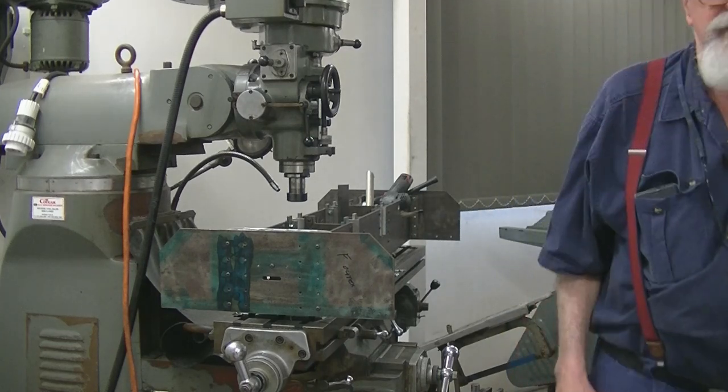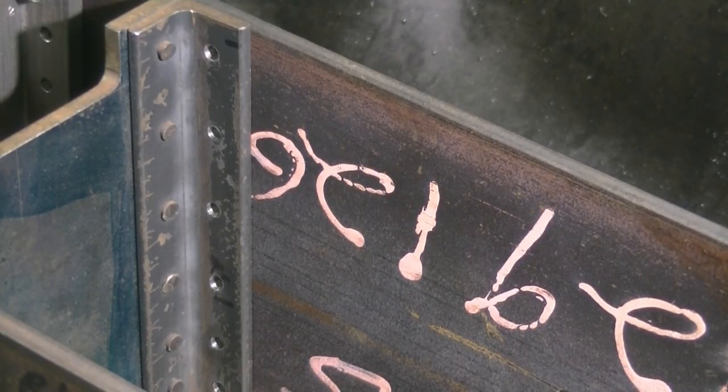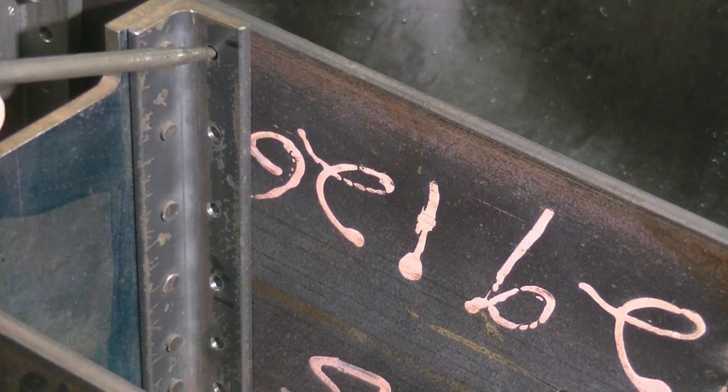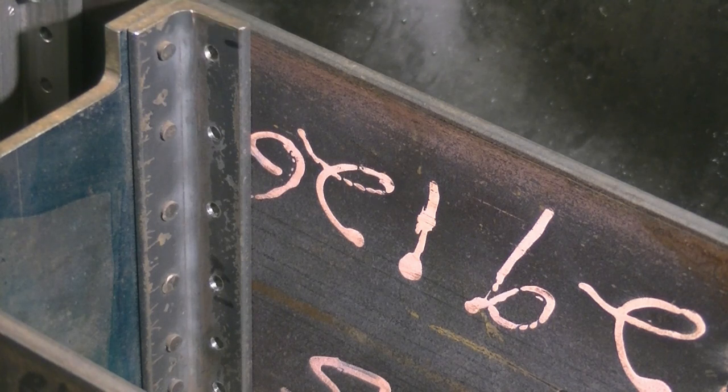Okay, bring you around for a closer look. There we are, that's a close up of it in situ. Now what I have been doing is putting the drill through there and clearing those holes out, and I got it a little bit better. Now I've got it bolted up on this side, the near side to us. This part of the frame can pull across quite easily where it's vertical, but these holes here are mismatched substantially. I'm not just going to drill it through bigger and bigger. That makes the frames a little bit weaker there, and I think there might be a slight tilt in that face of the bracket there.